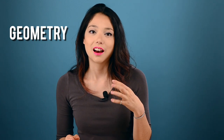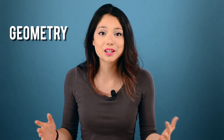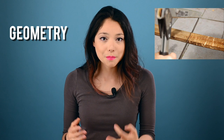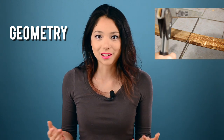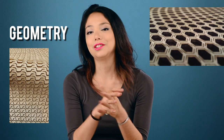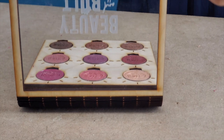Alright, we made it! Now that you're an expert on the material science behind living hinges, we can finally talk about how the geometry of the design impacts the hinge. Living hinges can be created through a multitude of methods. In this project we used kerf bending, which is the process of cutting a number of slots into a piece of material that'll allow it to bend. Designs include wave lattice and beehive lattice patterns, or wherever your imagination takes you — within the restraints of physics, of course. We used the straight lattice pattern for ours, which is one of the most common ones.